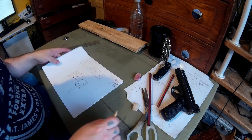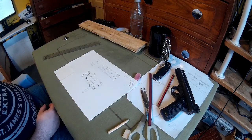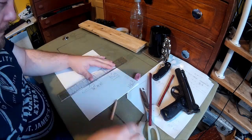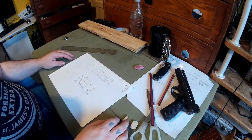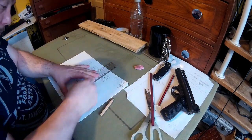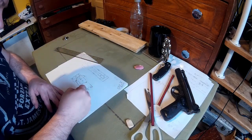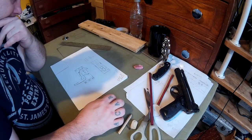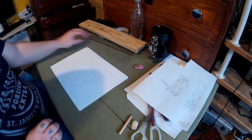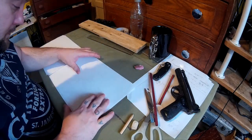After finishing the trigger design I'm starting to design the stock. The stock is going to be made from scrap plywood — anything I can find. I also have an aluminium rail which makes the string last a lot longer. The crossbow is planned to be in between a pistol and a rifle in every way. The prod should be about four inches smaller than a rifle prod and the whole stock is about four inches shorter as well, so it's going to be quite a compact short rifle basically.